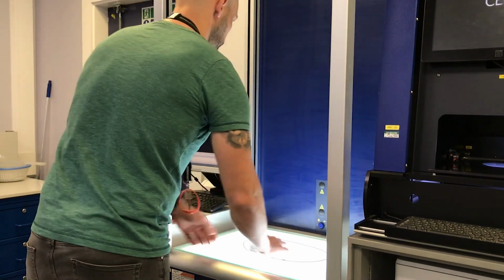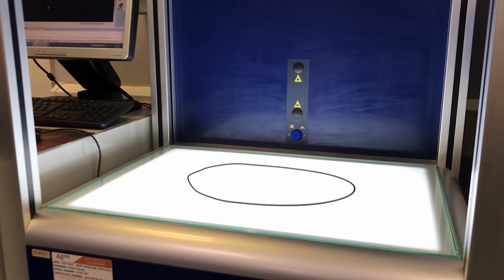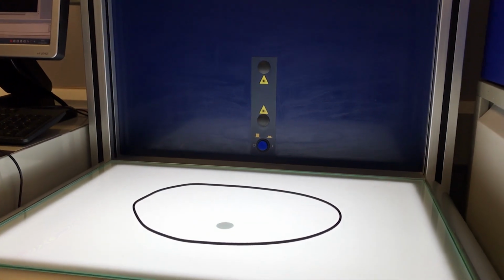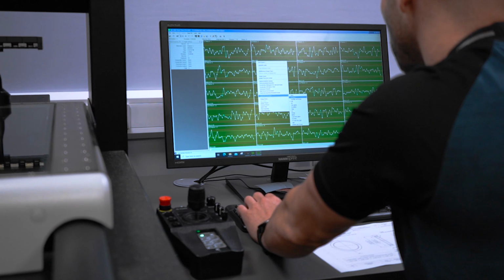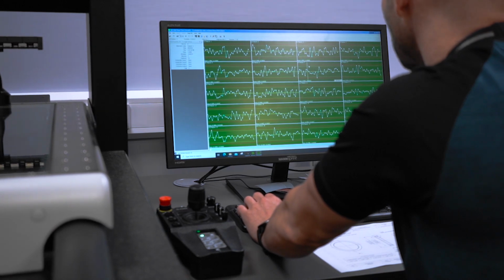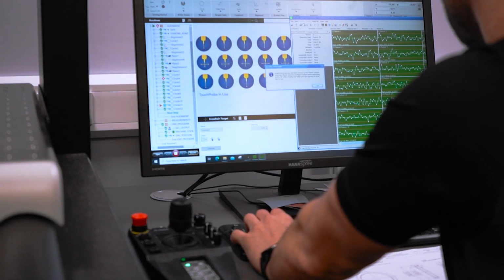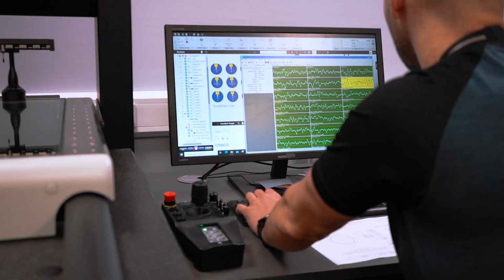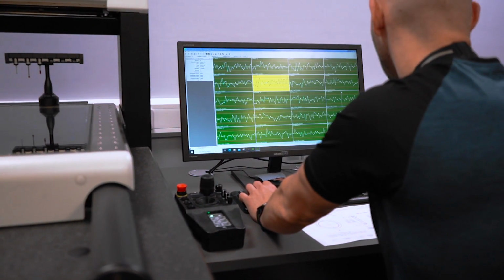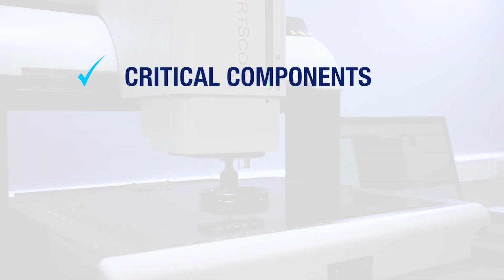However, more complex shapes with 3D structures and profiled surfaces are not suited to this method of dimensional measurement. Another benefit of the CNC multisensory system is automated acquisition and storage of measurement data for each component. This allows comparisons to be made with previous batch data and the opportunity to spot trends and deviances over extended time periods. PPE supplies some of the most critical components for downhole operations.